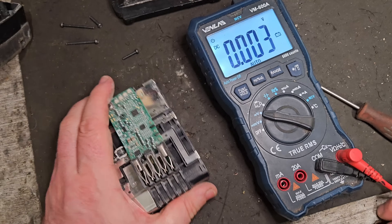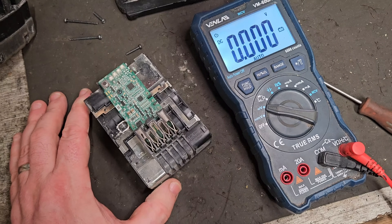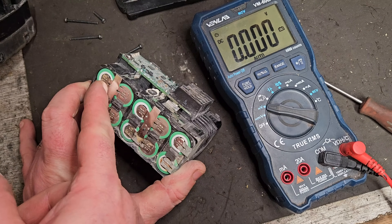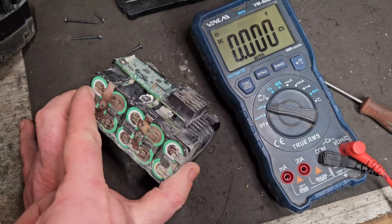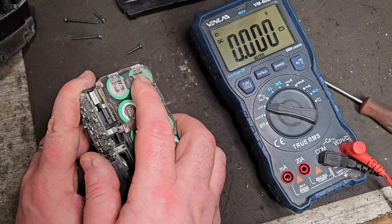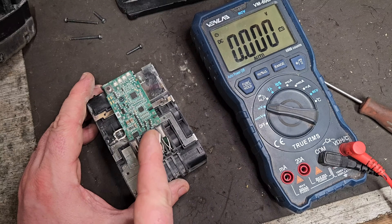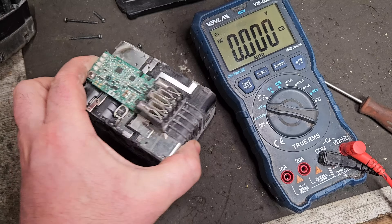So that's quite a bit lower than the rest, and I'm going to explain what that means. When I put that battery in the charger, because these four banks of cells are fully charged, they stopped the charger — the board stopped the charger from charging it any further. Therefore these cells are sitting about a volt lower than they should be, and the battery is telling us it's fully charged whereas it's not, because these two cells are lagging behind. And when I put it on a drill, because the drill has detected these are below workable voltage — even below the minimum workable voltage of these cells — it stops the power going to the drill. So that's why cell imbalance across the board is so important and that's why we need to remedy it.